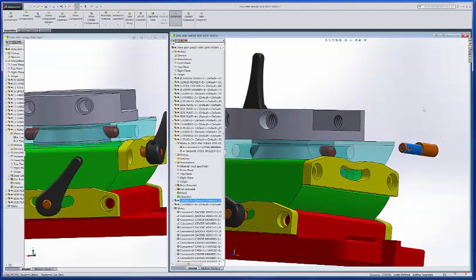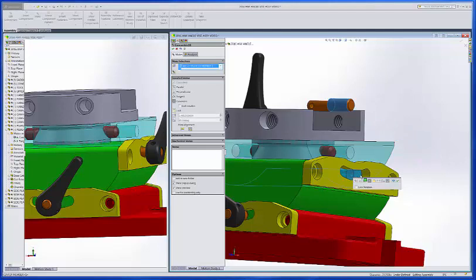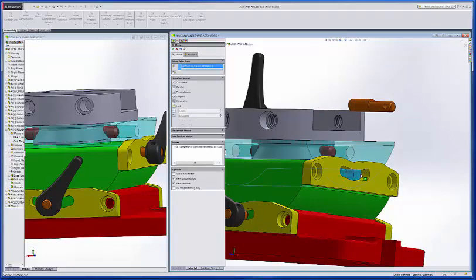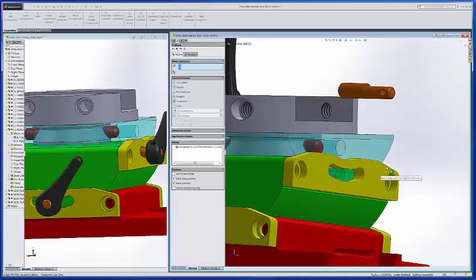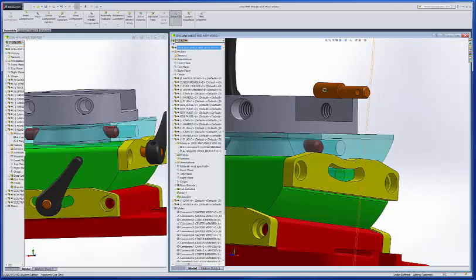These cams will just go in there — go ahead and do your mates, and you can do that while the plates are on there. That's the wrong way, so I'll flip it — that is the correct way. I grab this face right here and that face right there. It looks like I didn't get the right face on that bottom, so let me clear the selections. I probably got this one — I really need to get this face down here. And that face right there. We'll accept that. The concentricity must have gotten screwed up on this piece right here.